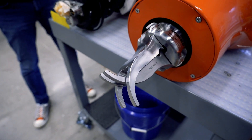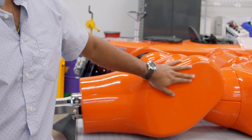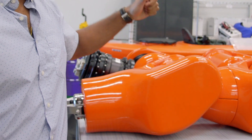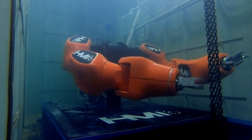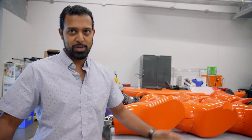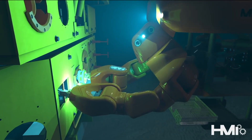This is Aquanaut's manipulator arm. It is all-electric — that's an important characteristic, it doesn't require complicated hydraulics. Because it's all-electric, we also have a lot of new sensing capabilities: torque sensing, so we can actually measure the forces we're imparting on the structures we're working with. On top of that, they're covered in composites that make this thing pretty much bulletproof — truck-proof even. You're dealing with all these giant steel structures in the ocean that you're going to be bumping into with currents, so they've got to be robust as well as functional.